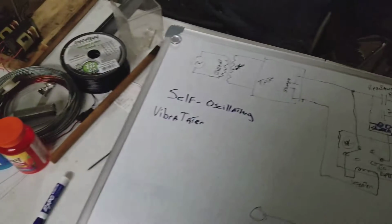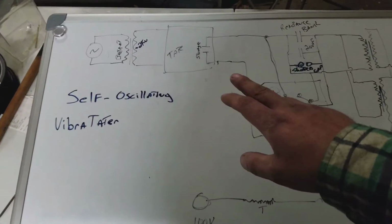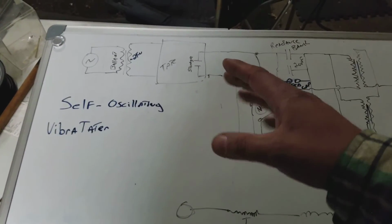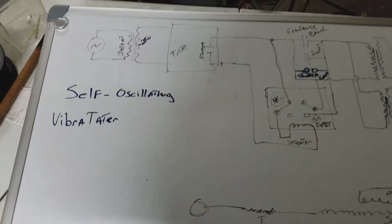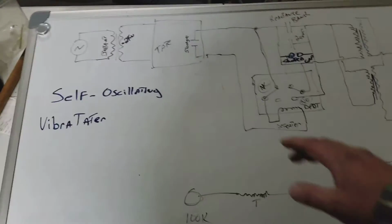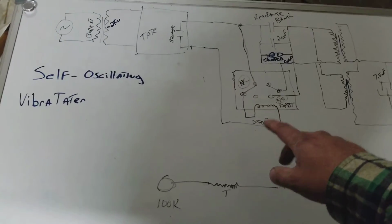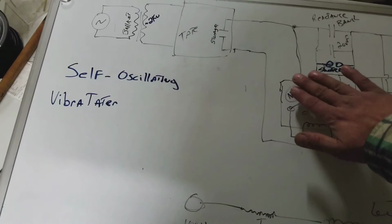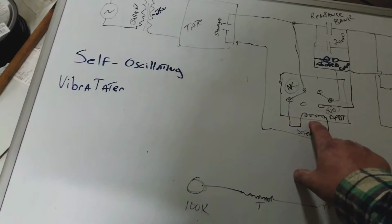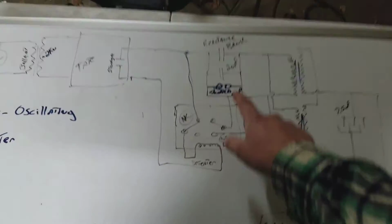There seems to be some kind of, I almost call it modulated DC. It's an AC signal that's still kind of noisy coming out of there, in addition to the DC, because your meter will read the DC and obviously it behaves like DC, but when you place any inductance or some inductance in series, the circuit oscillates by itself.